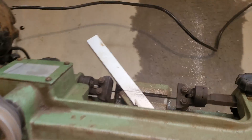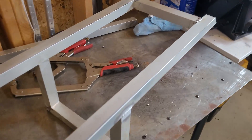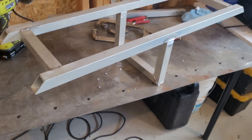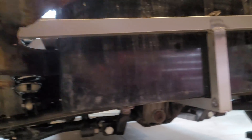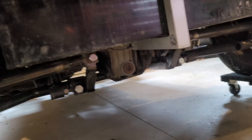Now that the shell of this mount is made, we have to create a bottom for it to hold the cell from underneath. A few 45-degree cuts and straight cuts later, with some welding, and there's our finished aluminum weldment to hold the cell. The top strap is just a bent piece of steel with some riv nuts in the tube — makes it easy. It keeps spring tension on the steel so it shouldn't rattle around at all.